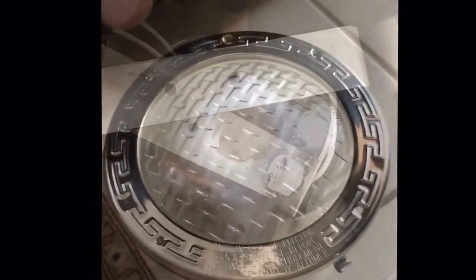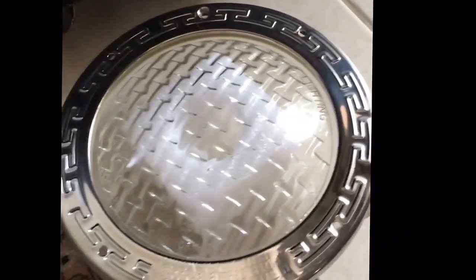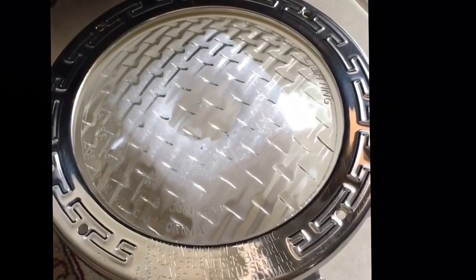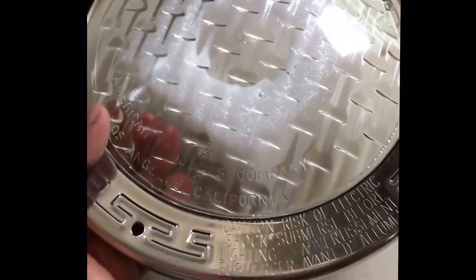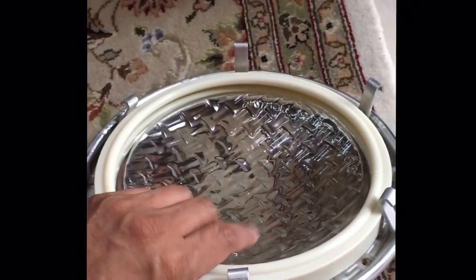Here's the new light assembly — I cleaned it because there was a lot of scum, salt, and buildup on top. I soaked it in a mixture of 30% muriatic acid and 70% water. Everything just comes off; you brush it a little and it dissolves. Leave it in for about five minutes, then make sure you install a new gasket. The light basically just goes around the gasket and installs from either side.